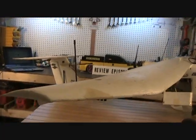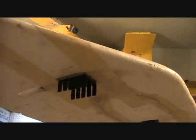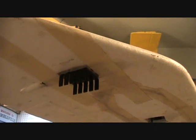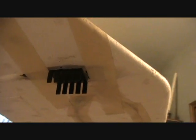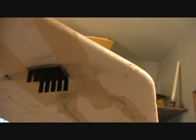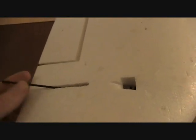Out on the end of the wing tip here I've mounted the video transmitter. This is a Racewood Red Label video transmitter — it's 800 milliwatts. I put a heat sink on it just to make sure it stays nice and cool. I've also left an area for air to come in and an area on the top for the air to exit. And I've made it so that on the top of the wing I can push the antenna down like this, fold it down during transport, and when I'm ready for flight I can tilt it back up.